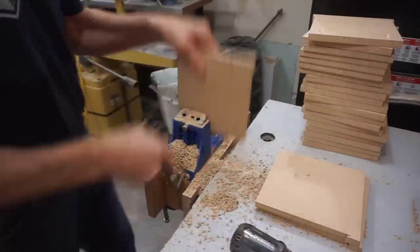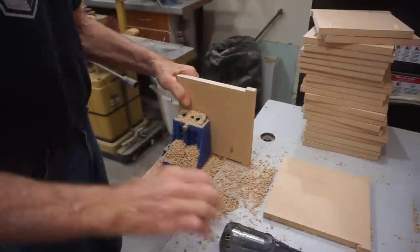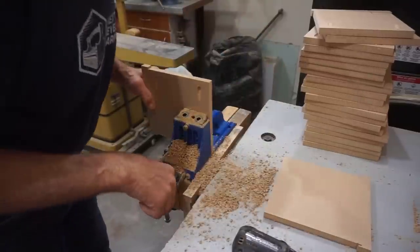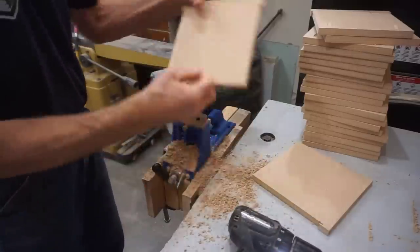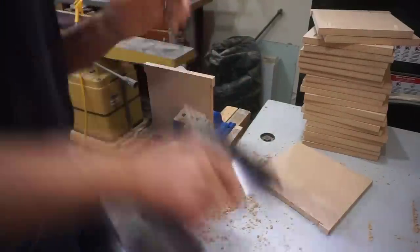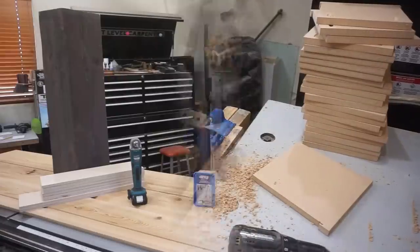Then I flip to the block's other face and align the block sides with the jig's sides to drill 2 more holes in the bottom edge of the block. Screws in these holes will hold the bottom of the beam firmly during the final glue up. Although all six holes are strategically placed, the beauty of this design is that precise location isn't really necessary.